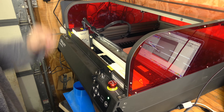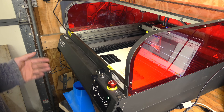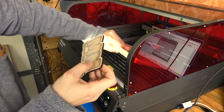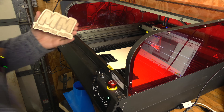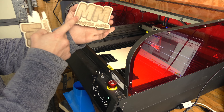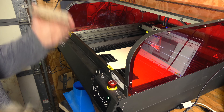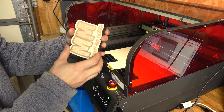That was without noise cancellation on the microphone, sitting about a foot away from the laser. We're four minutes and fifty seconds into the engraving, finishing up our logo, then it will cut it out. My second one just finished up. I ran this one at 5,000 millimeters per minute with 18% power for engraving, and 700 millimeters per minute at 60% power for the cut. Still a little bit around the edges — bumping up to 65% power and we'd be good to go. You can see this one at 6,000 mm/min versus 5,000 — the 5,000 runs slower so it engraves a little bit darker. These came out pretty good, about 15 minutes to cut one — about wallet size.